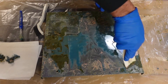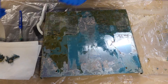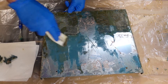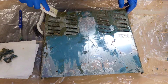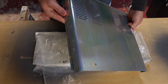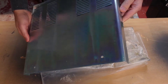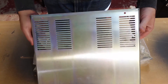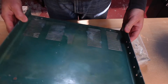There are some areas of the original color coat that may look like they haven't been touched, but all the paint including the lower layer has been softened. That layer is very sticky and not coming off easily with the scraper. I took it over to the utility tub and was able to easily remove the remaining residue with a mild Scotch-Brite pad and some warm water. The paint is almost entirely gone. I tried using a razor blade to scrape the remaining small areas, but that was a bad idea — the razor started digging into the aluminum. So I did a second application, and that removed it.